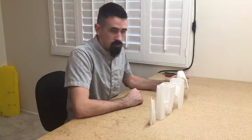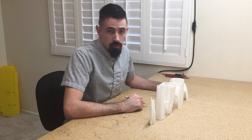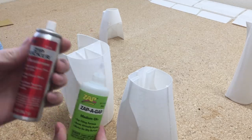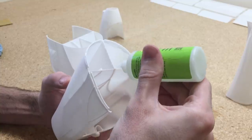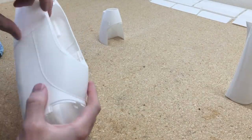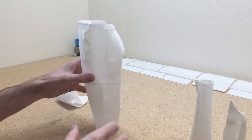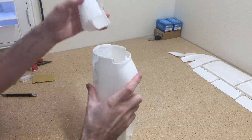The first thing we're going to work on is the fuselage. We're going to start cleaning up all these parts with an X-Acto blade and get them all cleaned up and start gluing them together. I'll be using Zap-A-Gap medium CA glue to assemble this airplane, and I have Zip Kicker CA Accelerator to spray on the parts to accelerate the cure time. When you spray that on, it basically cures the glue immediately. I don't like to use it very often because it turns the glue a little bit yellow and bubbles it up.